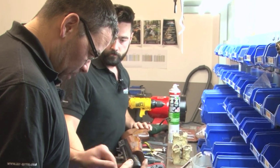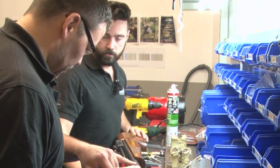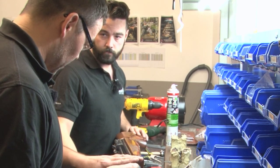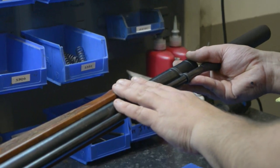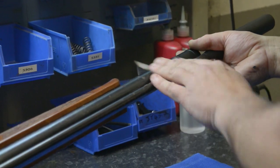Yeah, I can get this sorted out. Looking at the cylinder here, we've got a date on here of 2005 when the cylinder was manufactured. What we do these days, anything over ten years old, as a matter of course we change the cylinder over anyway. So that will go lovely and black.